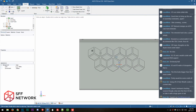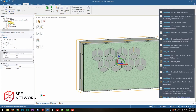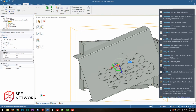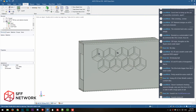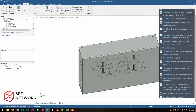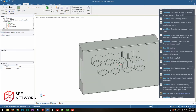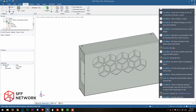But the advantage is that this panel can be mounted either way. So you could either have it like this, or you could rotate it and it would still fit. If the vents are symmetric, then that's fine. Or if the panel is otherwise symmetric, then it's actually better. Because with parts, it's not usually a good idea to have stuff that's almost symmetric, because it makes it a lot harder during assembly and manufacturing.